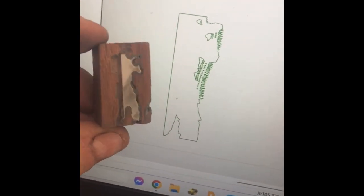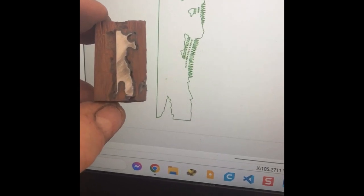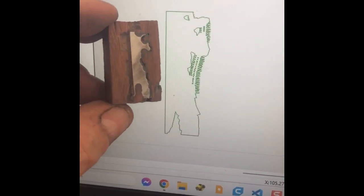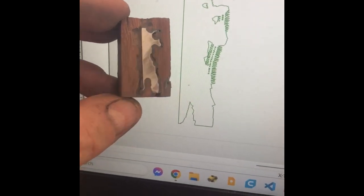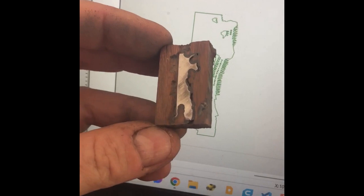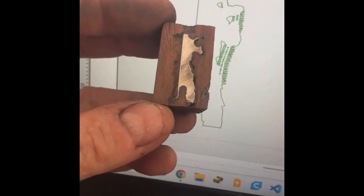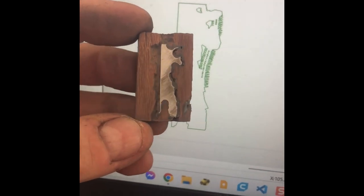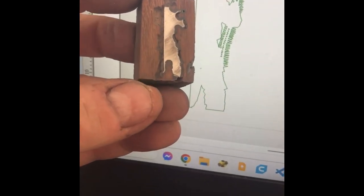This is the first result of trying to inlay in aluminium — it hasn't gone well at all. You can see a vague resemblance between the shape it should have been and the shape it is. I was trying to get the resolution of the belt of rounds there, but it's nowhere near. If you look closely you can see a gap between the aluminium and the glue — I think when I pushed it in it didn't register properly because the straight line on the left side had nothing to locate it, and the whole thing moved. So I'll have one more go, machine it all up again overnight, and see what it looks like with perhaps a better fit.